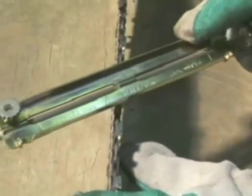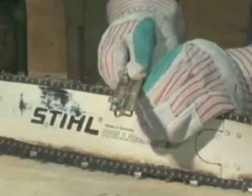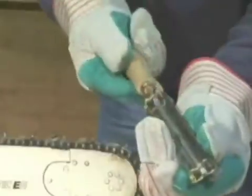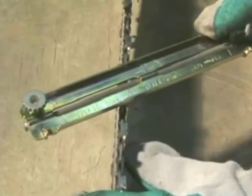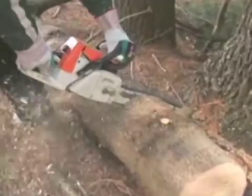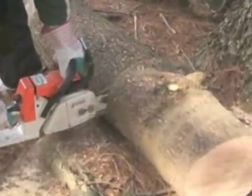Press the holder firmly against the top of the cutter. Keep the holder level and count the number of strokes used on the first cutter. Check the cutter for sharpness. If the cutter is sharp, take the same number of strokes needed to sharpen the first cutter using the same pressure. A chain sharpened at the correct angle will feed itself into the wood.